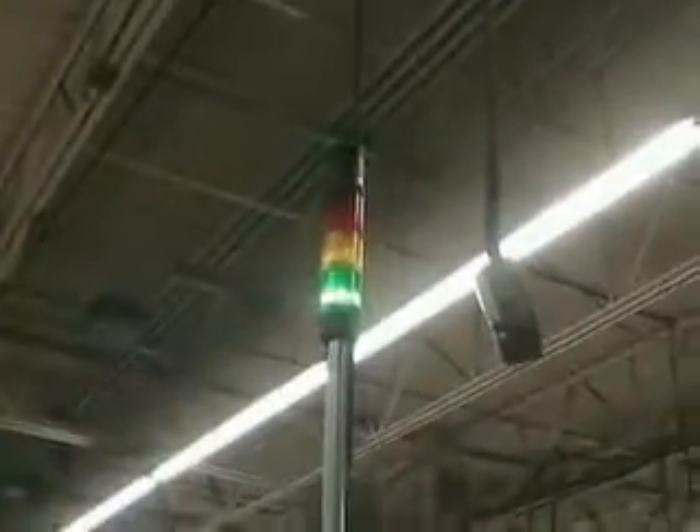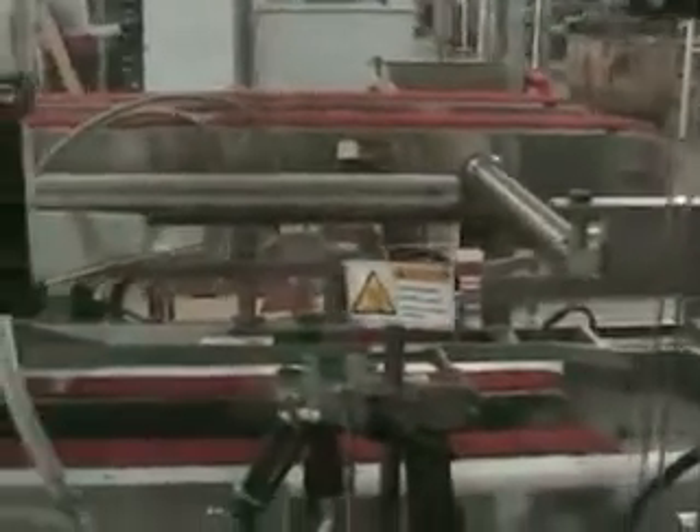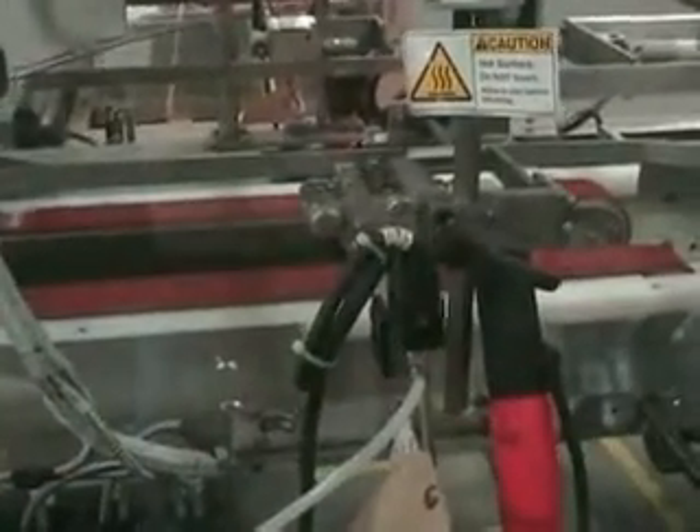Here's the light magazine for the case packer as well. When the case is loaded, it's sent ahead into these intermittent belts that will bring the case past an ITW extruding system that will apply the appropriate glue onto the case, and then the case will enter into the pneumatic compression section.